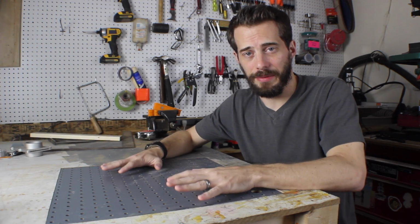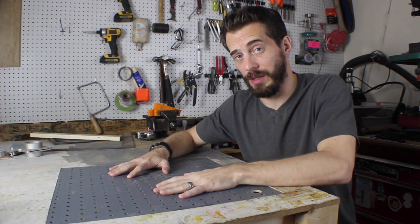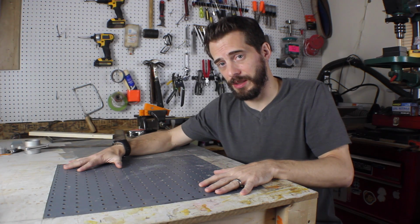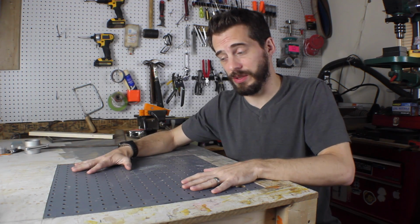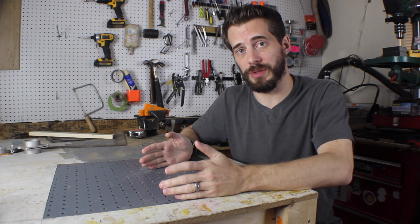There's a couple things about this. It works best with really fine dust, so it works better for sanding rather than cutting. And the larger the area, the less suction you're gonna have. So if you don't have enough suction, you can mask off an area of it, which is gonna pull more air through fewer holes, and you get better suction.